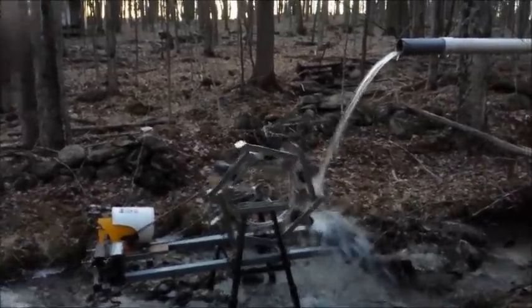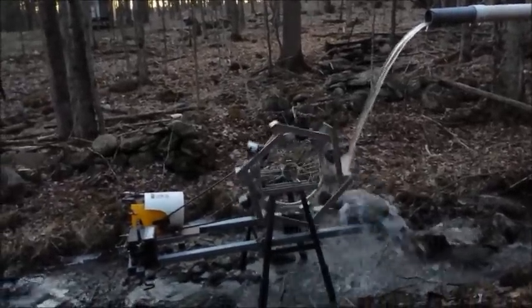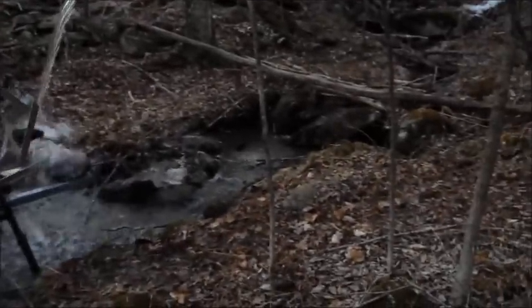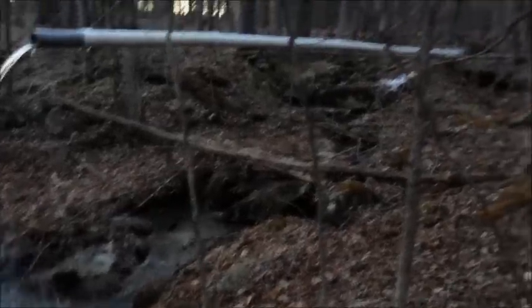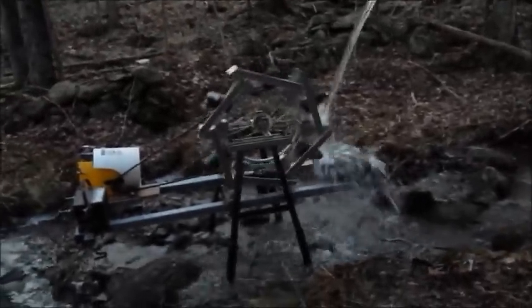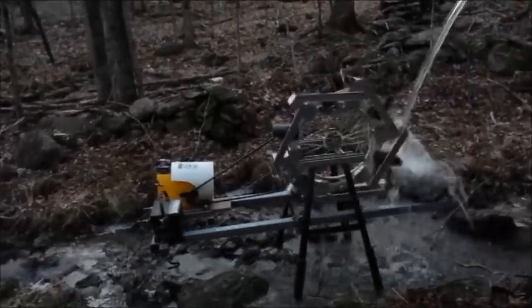Well there it is. I consider it a failure — it works, but the alternator is quite a restriction on it. I would probably need most of the water that's actually coming out of the stream, or if I were to really lock it all in up there. I need a lot more water and maybe a bigger wheel to really crank power. Not a total failure, but it's barely turning the alternator — if I turn the field on to light the light, it stalls.